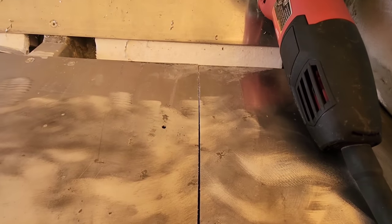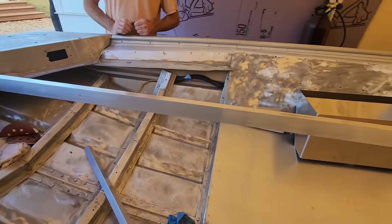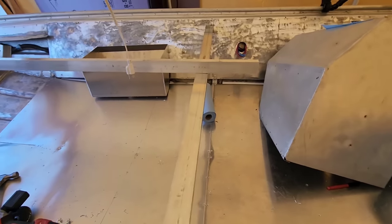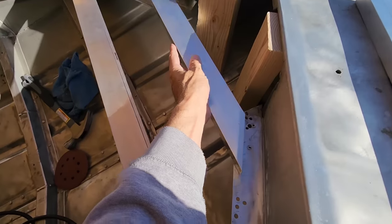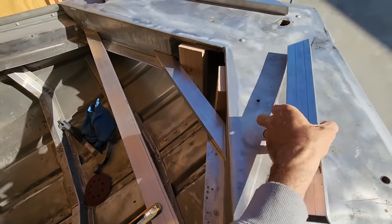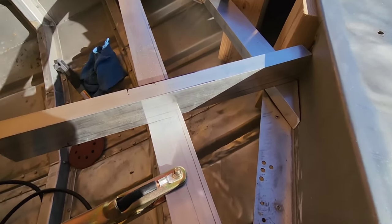We cut relief joints in the factory side panel to eliminate bubbling. Then it was time to start the front deck framing. This process takes great consideration. I have to think about deck length, hatch sizes and locations, layout, frame it square, and planing without humps or bumps. Things need to be centered and symmetrical, or mistakes will show in the lined EVA foam later, given that it runs off of center. You get the idea, there's just a lot to think about, but this is the part where the creation really comes to life.